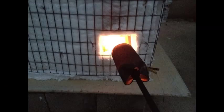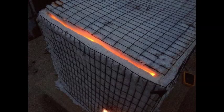My cat Casey is out here with me now. Up to 1300 degrees, got about 35 minutes to go. Figuring 20 minutes to hit my 1650 degree Fahrenheit target temperature, then a 15-minute soak at that temperature — the whole thing will be done in two hours. Amazingly I'm still on those almost-empty two tanks of propane that I started with. Beautiful evening, about 80 degrees, though it's hotter than that out here on the dock with this kiln radiating heat. Life is good.